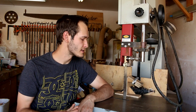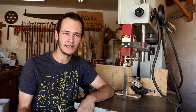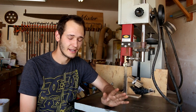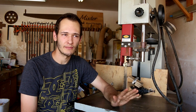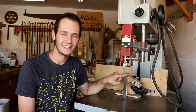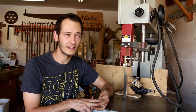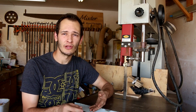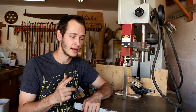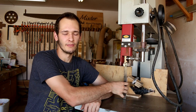The Grizzly bandsaw blades would snap — I had one that snapped after only a day of use, just cutting wet mesquite, which isn't even that hard. Eventually all my Grizzly blades snapped within a couple of weeks. Timberwolf blades, on the other hand, last months. I have three — two one-inch and one three-eighths inch — and out of all of them I've only had one very small fracture after a lot of use and a lot of ironwood cutting. Ironwood is hard to cut and puts a lot of strain on the machine and the blade.